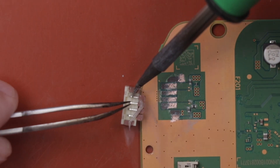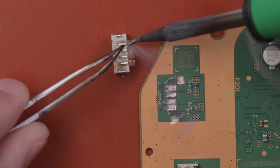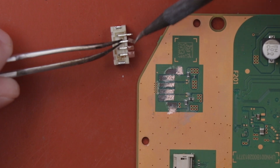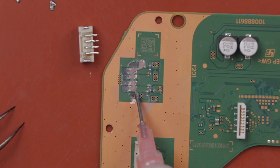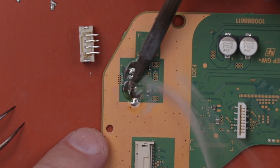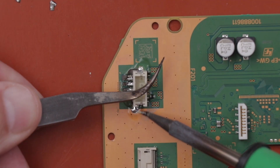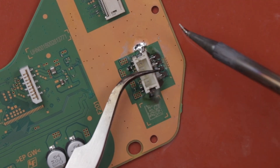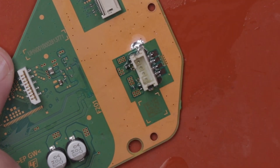Before I go to solder on the connector, I will remove these brown pads that were torn up from the board, and that will enable me to solder this connector right down onto these fresh new pads on the board. Now with the solder mask removed, the solder will stick to it. We're going to put some flux on these pads first — flux just helps the solder flow. Then I'll come through with my soldering iron and add some solder to each of these pins. That'll make it so when I go to solder on the connector, the solder from the connector will stick onto the solder that's attached to this board.